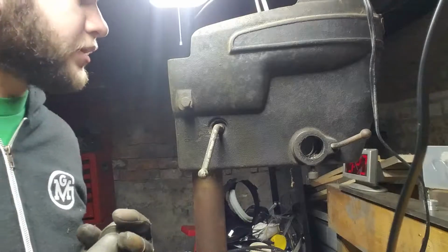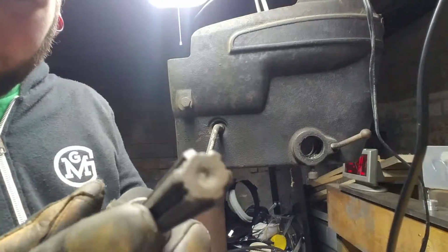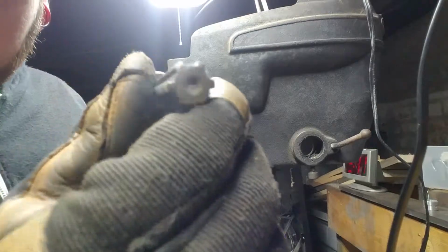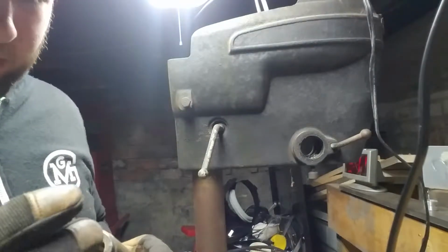Okay. So that's nice. So for engagement to the upper pulley spindle here, the back end of it's actually cog gear. A lot of the ones I've dealt with, that's actually really cool. See if you can see that. Try and focus it. Damn, it's not going to focus. Anyways, there's little tiny teeth in between the main large teeth of the gear there. Anyways, so yeah, it's actually not a 6 tooth, it's a 12. Little tiny guys in there, that's kind of neat.